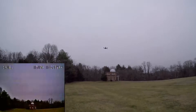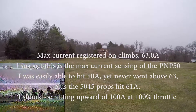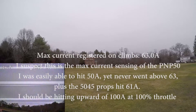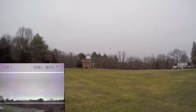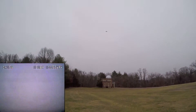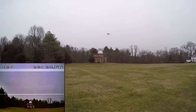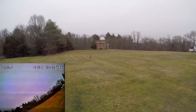In conclusion, the only issue I can find with this frame right now is that it can't slow down. I don't know if it's because of the six-inch props and the heavy motors, but it's having difficulty slowing down the propeller speed. I'm used to being able to burst the throttle and have the quad drop as soon as I drop the throttle. This quad doesn't drop, it just slowly settles, which is kind of weird. It's kind of nice, but it's a bit slow.